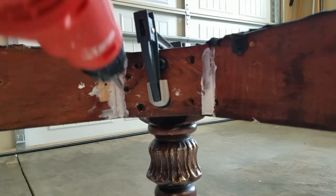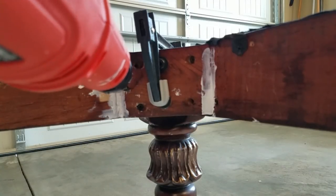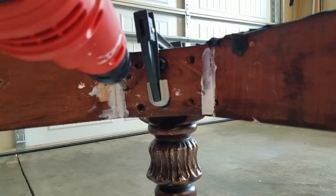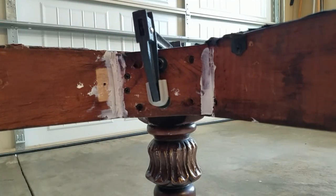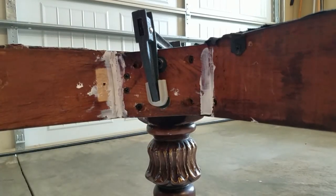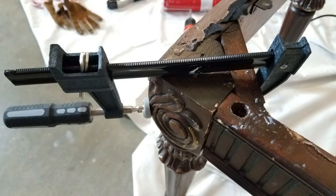Having fallen in love with construction glue, I make sure I have plenty of it on hand — the Gorilla brand, of course. I was a little concerned about one of the corners, so I did apply some glue there as well as a few additional screws, and then I clamped it in place overnight. Just taking a precaution. If you feel that way about any area of your piece, take the precaution — apply the construction adhesive and wait 24 hours.